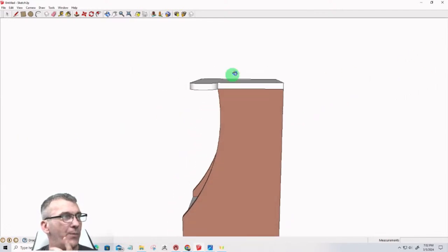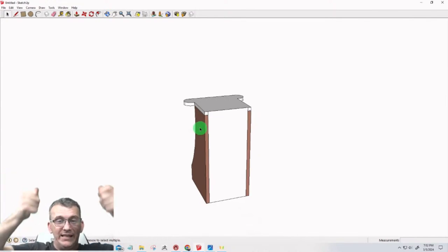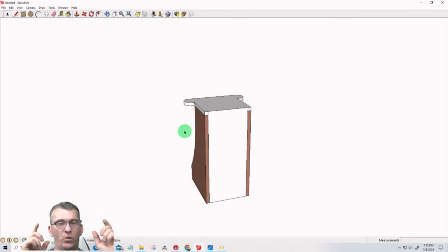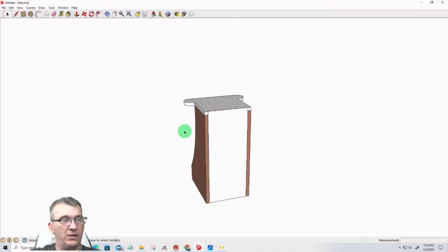Now, the most important detail of this is the raising, the elevating of the top, and I want to keep the exact design. They have a square 1-inch by 1-inch tube, and then a slightly undersized square extrusion, 1-inch by 1-inch. And then inside they've got probably a 7/8 round metal tube that goes inside of it with knobs and stuff.